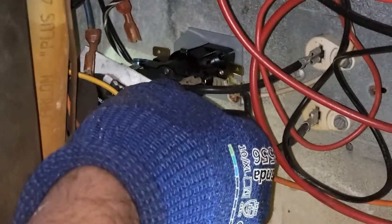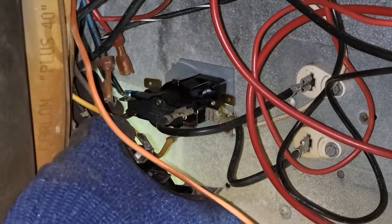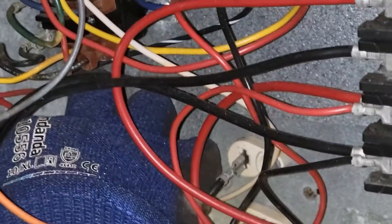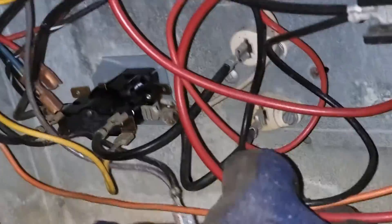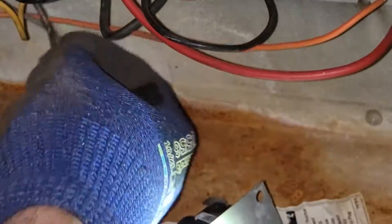You'll need to get some needle-nose pliers. We've only got about four wires left. It may be easier if you can't get your hands in here to put all those wires on the sequencer before you actually mount it in place. Make sure the spade connector is nice and tight, so that when you put it on the terminal it's not easy to just pull it right back off.